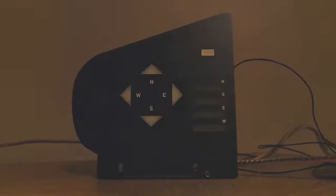Now all of them. And we do a brightness test where we increase the brightness on the bar gauges and dim it down again. And also on the arrowheads and the diagnostic. And then a test on the audio tone generator on the board. And at the end of that audio tone generator test, it will just go back round the cycle again. So there we go, we're going back into testing the bar gauges now. Let's power down. And finally, let's show what happens in input test mode.